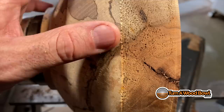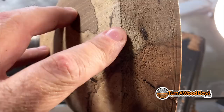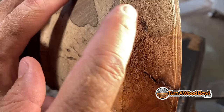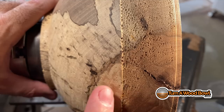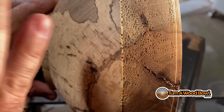I've deliberately chosen this to show you what end-grain tear-out looks like. Now we need to talk about the anatomy of end-grain tear-out. I'm moving my light to the side of this bowl — almost like the sunrise coming up across the ground — to highlight the high areas and show the shadows of the dark areas. What we need to know about end-grain tear-out is that it is not just a surface problem; it runs deep into the wood. Those straws aren't being cut smooth across the top — they're breaking off, some way down below the surface, and then those fibers are getting ripped out. That's what end-grain tear-out is.